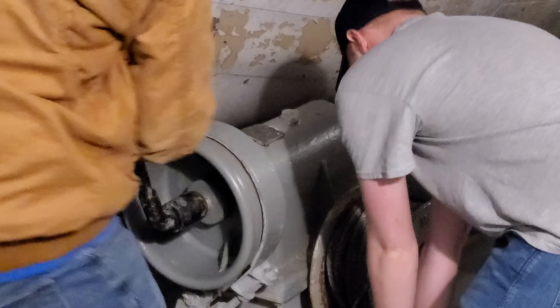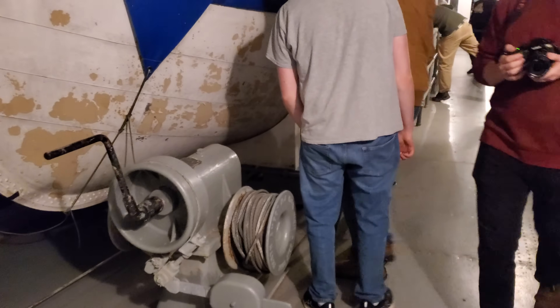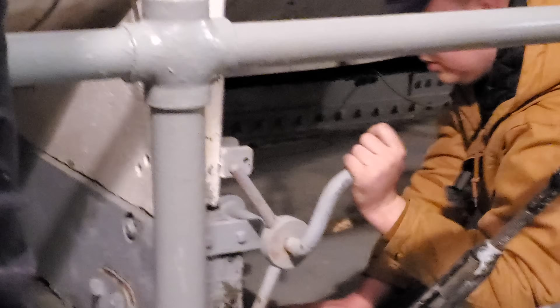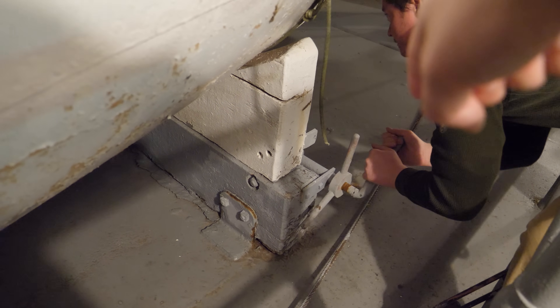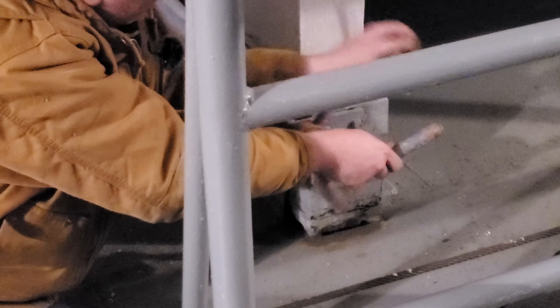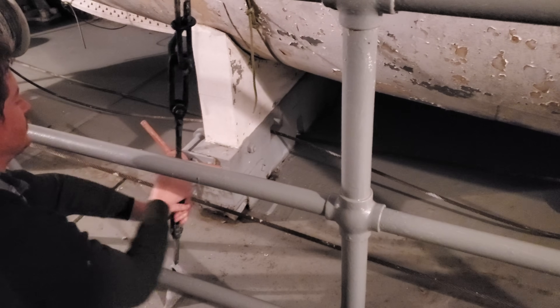The boats appear to be down. One of the last steps is to lock the boat in place using the keel locks. Each boat has a forward and an aft keel lock that holds the boat in place against the chock and prevents the boat from rocking back and forth as the ship does. Once it's been lashed back down, the boat is now fully stowed until it is needed again.